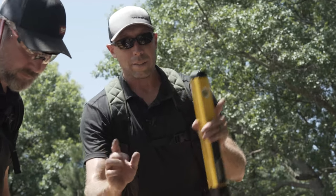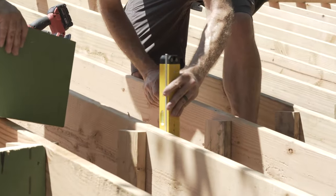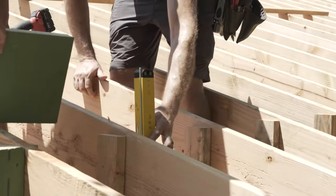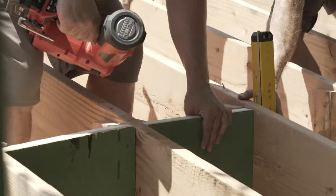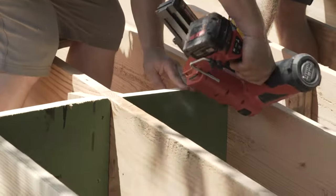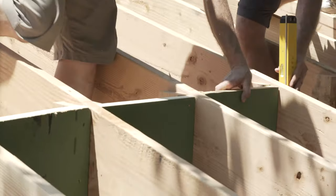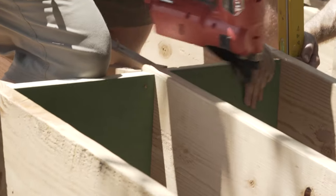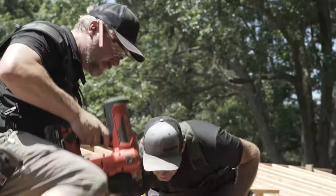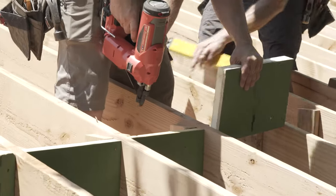We use the blocks to hold things bottom corner, top corner, square. Once we plumb this — with a little pressure back there, Joe nails it down here, and that's what's going to hold it. Set the other side first, Joe, then that secures a point. We plumb every other one because that's obviously already plumb, so the other side drops in and we nail it. We're plumb here and we just keep going all the way across the wall — all the rafters get plumb — and those exposed tails really serve the architectural feature intended for them.